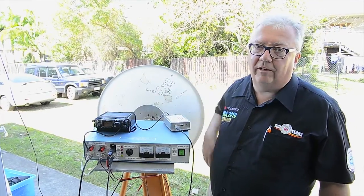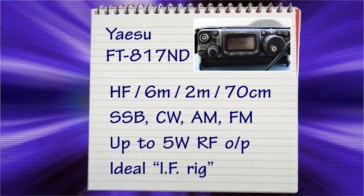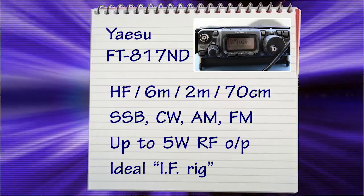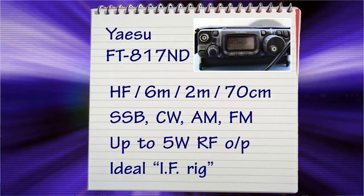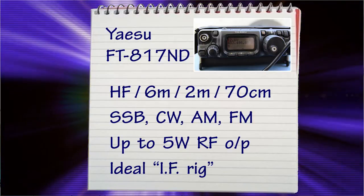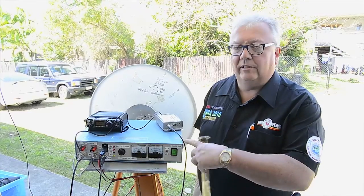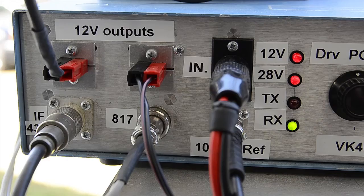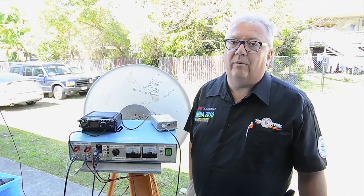They're all designed to run around an FT817 — a beautiful little transceiver that's handbag portable. Some of the transverters have 432 MHz IFs, some have 144 MHz IFs — it doesn't matter, the 817 will cope with all those. I've also built in power outlets so you're not fumbling with leads; everything just plugs into the front panel, making it very easy to use and quick to set up when going portable.